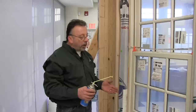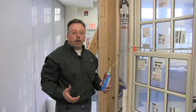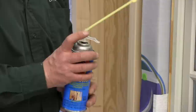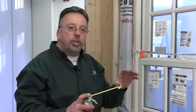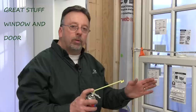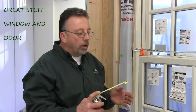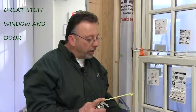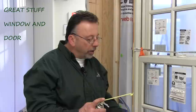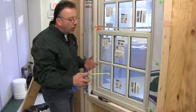We finished up the corners with the Pure Black. Now we're going to go around the inside perimeter of the window and use the window foam insulation. Primarily insulators are going to do this procedure, not necessarily the builder. You want to make sure that when it gets done, it's done completely tight — I've been to jobs where I'll see a break in the foam where it's not quite making contact with the window. We want to go in about an inch and a half, not filling the whole cavity. And at the sill, don't fill that whole void — just an inch and a half in as well.